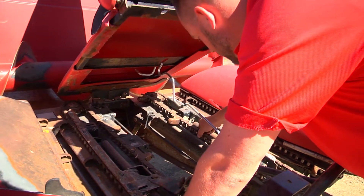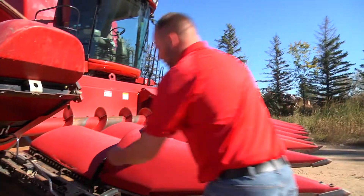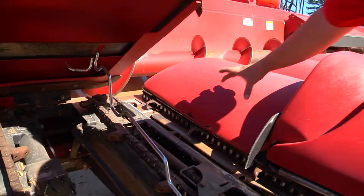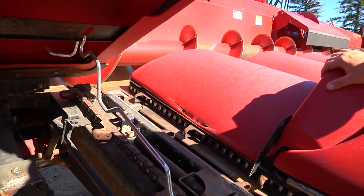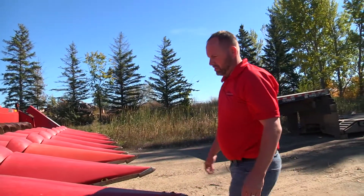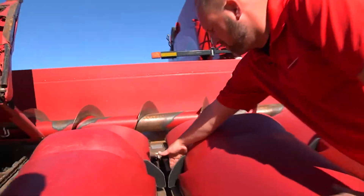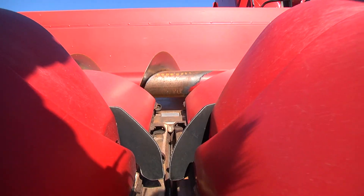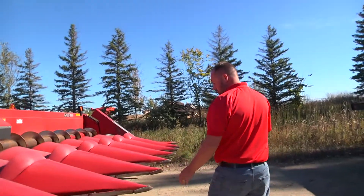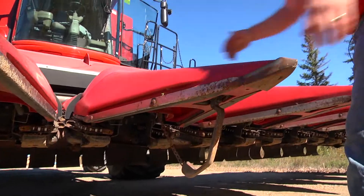Check your chains over. We do have a little bit of damage here — this is probably something where you can buy a stainless steel kit and put on there. Make sure your flaps are all in place. You want to make sure all your rubber flaps are in to catch all them extra cobs coming out. As we walk down, we got our center one here — make sure the chain is hooked up on that one.